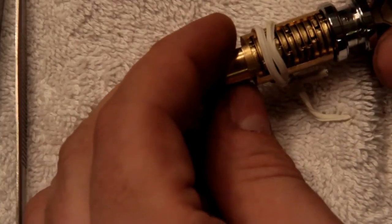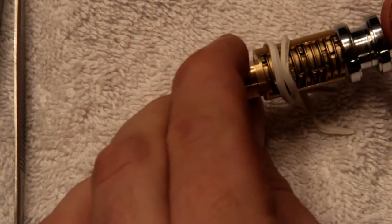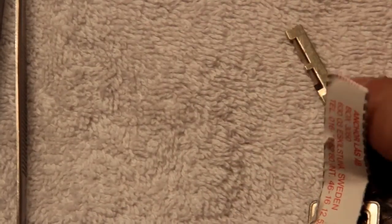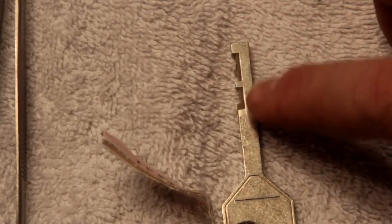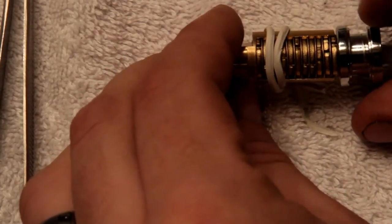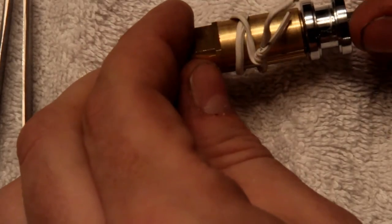The wires here help keep everything together. Now when you turn it further — as I was turning it this way — this is the locking area. A couple of these discs, which are known as zero discs, are places on the key where there's no cutout. Which means that the wheel turns all the way, full rotation, and it runs up against the side of this little window. When it does that, now when you twist, you're pushing on the plug, as it were. And if the sidebar has retracted, it is able to rotate and unlock the lock.